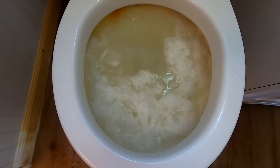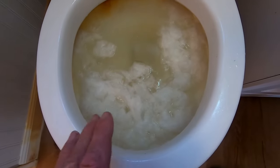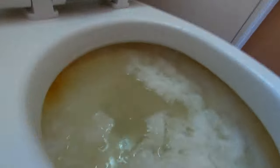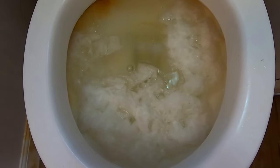We had an instant reaction from the baking soda and the vinegar, and you can see it's still kind of bubbling. What we'll find out in 15 minutes or so is whether it got down through the trap. These toilets have traps, and that waste is more than likely back in the back of the trap. So how could that water get through from up top and get down past that trap? We're going to find out if this home remedy actually works.